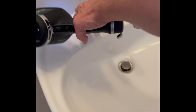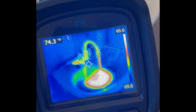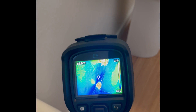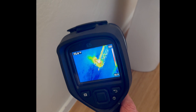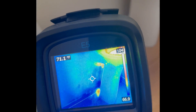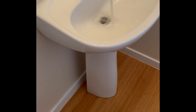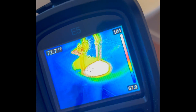Take a look at this sink. Turn the water on and we've got the FLIR E5. You can see the difference between the hot and cold water — that's definitely hot water. And very quickly, you can see something going on with the sink: that's the drainage pipe that's hot, and that is a leak on the floor. With the human eye, not much going on, but with infrared we can see something back there. That's pretty quick — I kind of like that. That's the FLIR E5.